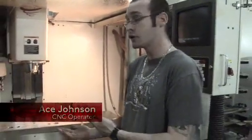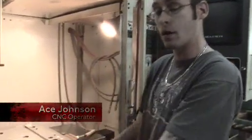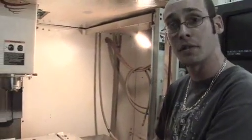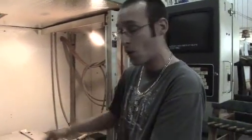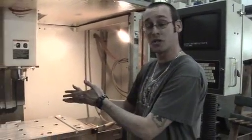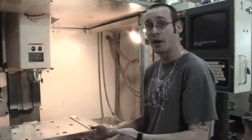For CNC machines, whenever we're done at the end of the day, I'll go through the back of this machine, clean all the Z-axis, clean out all the axes, clean out all the sawdust that we have, make sure everything's cleaned up, make sure all the oil's out of the way, make sure the machine has oil in the machine, and make sure all the airlines are ready for the next day.